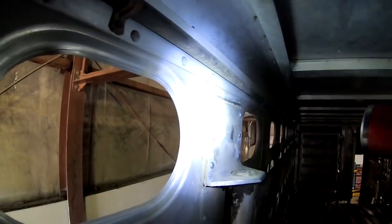And then this one up here was the hard one. I had to have the owner come in and help me with this one. This gate here, down on the bottom, he bought an $1,800 rivet gun. I didn't have a big rivet gun. After I seen the one he got, I'm going to get one. But the gate was all sagging, and this was worn out, and it was hard and really tricky. The hard part is trying to get it set up right, especially when everything's worn out, and getting it to where these pinholes line up correctly. It was tough doing it.